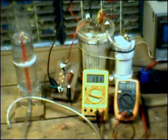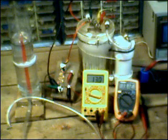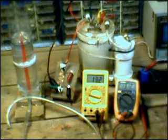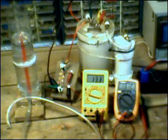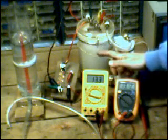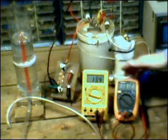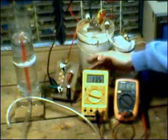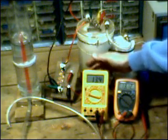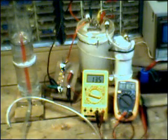I'm going to turn it on, and immediately you see the first wave of bubbles create a wavefront, and it just circulates so quickly that it creates a backlash. Then it fills the tank completely. The circulation runs out of the top of the plate stack, down the outside, and back up through the middle of the stack, and just keeps that circulating current going. That's also how it keeps itself very cool inside the car — this cell runs so cool that I have problems getting it up to temperature where it runs most efficiently. How's that for an interesting dilemma?